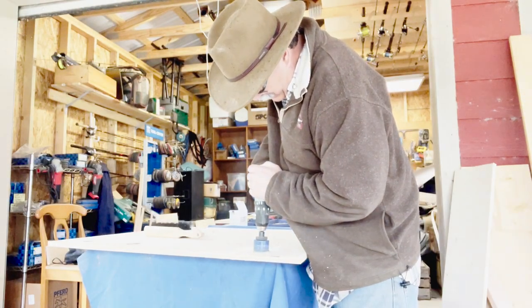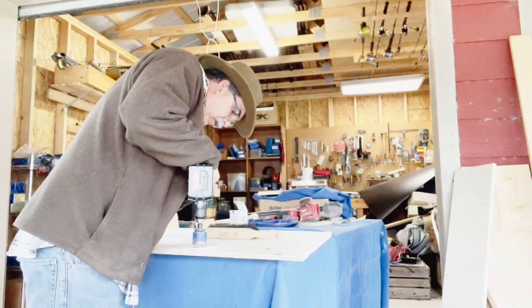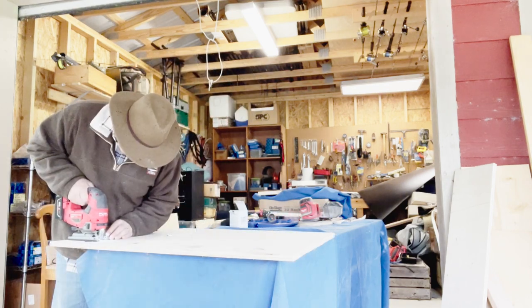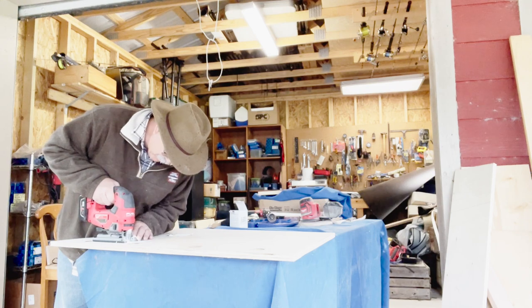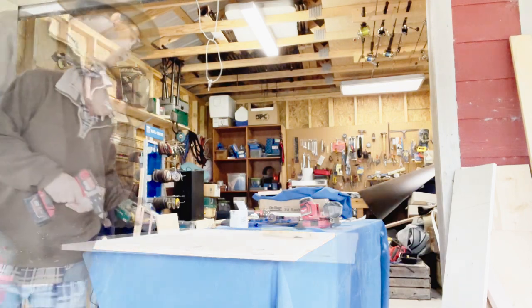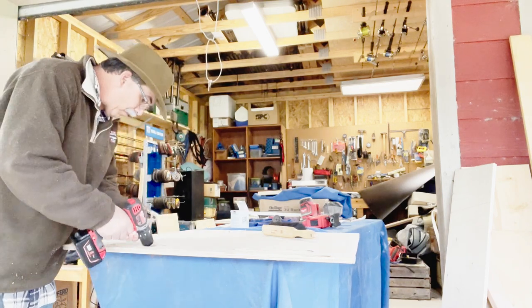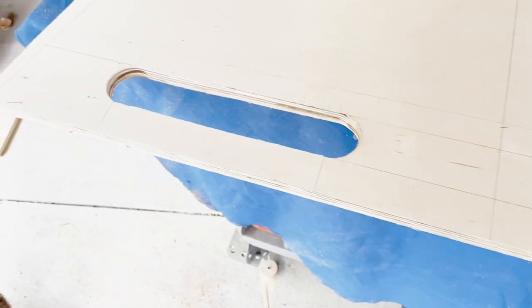You can see how that's braced on the bottom shelf. Here I'm just cutting some holes for that wire routing. I took a jigsaw — I actually drilled four holes and then took the jigsaw and connected them together. You'll see how that makes a nice slot to run the wires through a little bit later in the video. Here I've got a little sanding disc, just running around that with the drill, knocking all the rough edges off and all the splintering — just putting a little final touches on it. You can see the slots I cut out with the hole saw, combined together — a little bit nicer than a square, without any of those corners and rough edges.